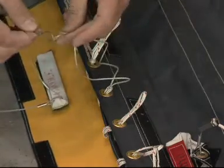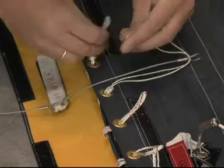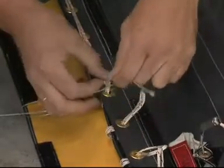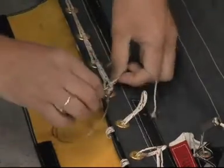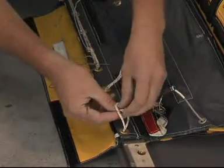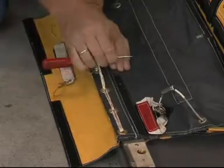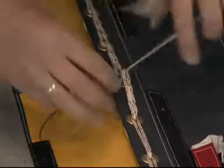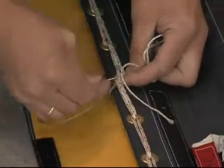Place the handle wire loop over the small cord loop before you place the long cord loop over the center. Secure it with the parachute pin before you continue pulling the cord loops from the other end towards the center. Secure both long cord loops over the center with a parachute pin. Secure the pin and remove the temporary tie.